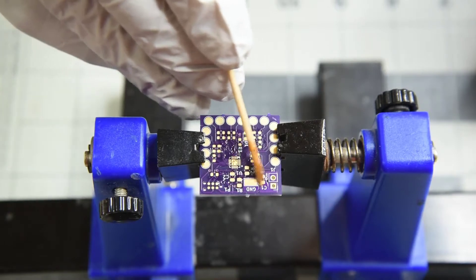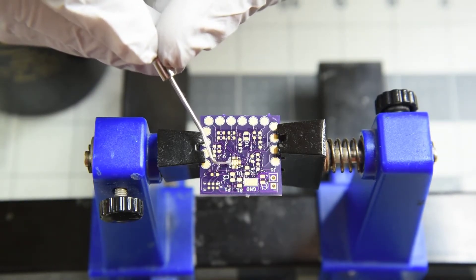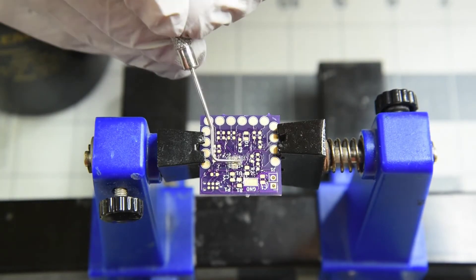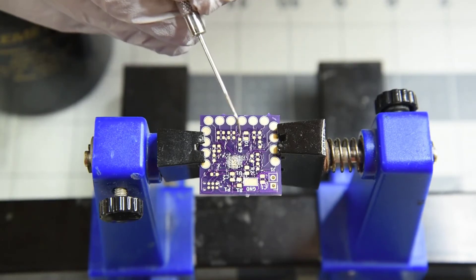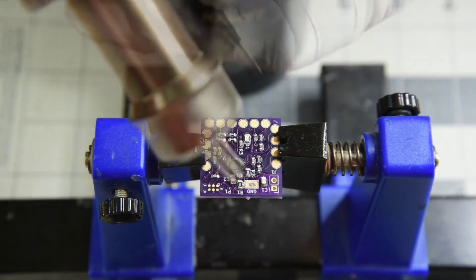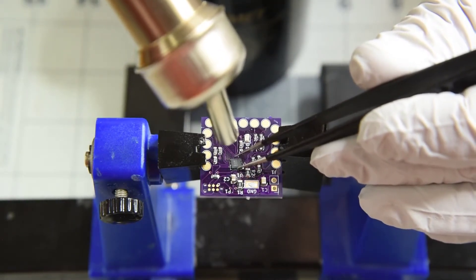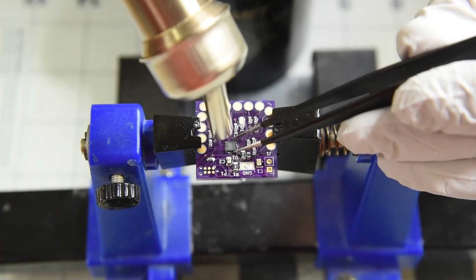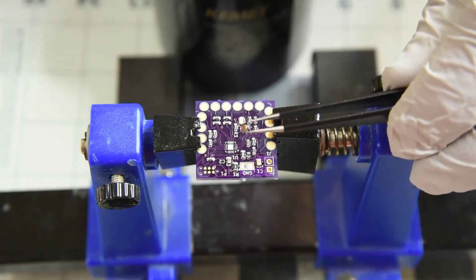I'm going to try the paste again. This time I'm going to spread a bit of flux on before applying the solder paste to see if it has dried out a bit — I don't think it has because it really flowed well. I'm going to spread the paste for the QFN pads with a pick to see if I can get it thinner and a bit more even. Getting a tiny amount of solder paste evenly on the QFN pads is going to be a challenge. I don't think this is going to work doing it by hand. Still too much solder paste in spots — a couple of pads bridged.